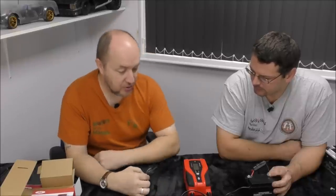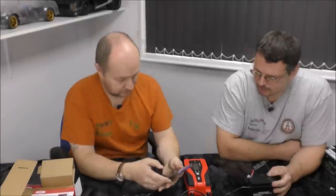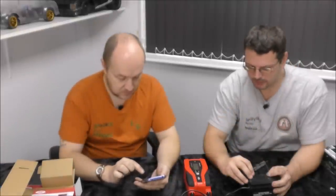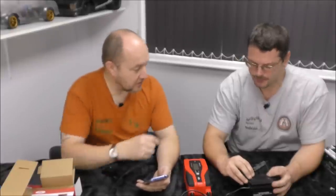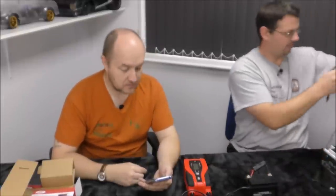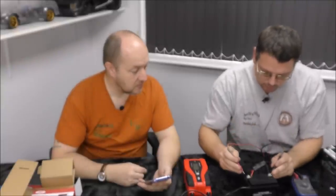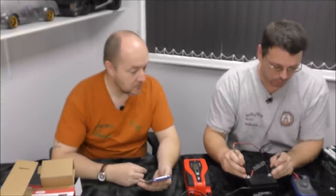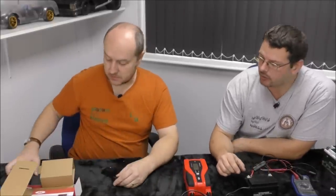Right, okay, so where's your app? Oh, me app. If it's not updating, there's not enough power in this thing to switch it on. No, it's not. Right, what was your voltimeter thing? Why can't you test it with that? I can, and it'll say something like 0.03 or... Really? Something like that, because this battery requires waking up when it's down, so 0.07. That's 0.07. So it's not so much that it's got no power in it, it's that it's got a circuit in there that switches it off.